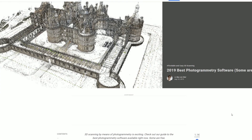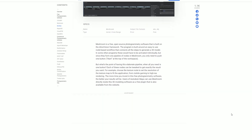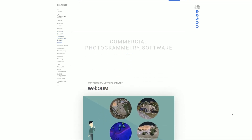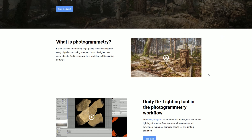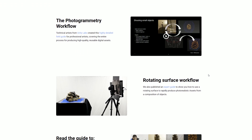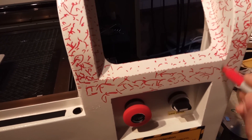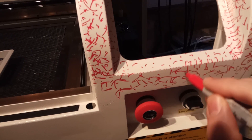I was going to use photogrammetry to help me build and design my mount. I've been wanting to try out this technique for a while and it was the perfect use case for it. For those that don't know, photogrammetry is a way of creating reasonably high detailed and accurate 3D models of real world objects by analyzing lots of photos and extrapolating features to build a detailed point cloud. A 3D mesh can then be made from this point cloud and placed within a variety of 3D modeling programs. So what I first needed to do was prepare my scan area so the photo scanning software can see the shape of the laser chassis — the very thing I wanted to place my mount into.